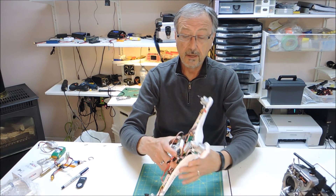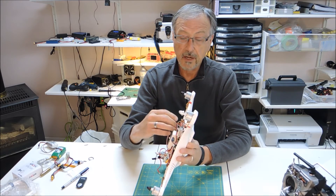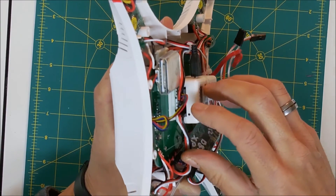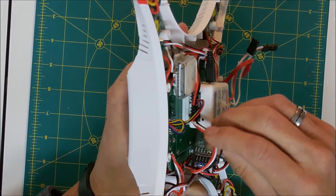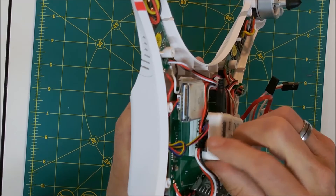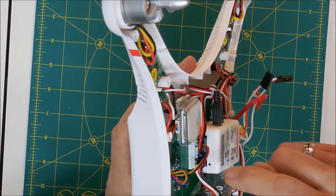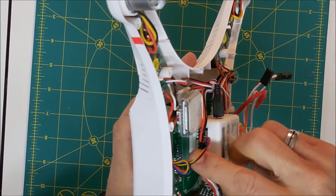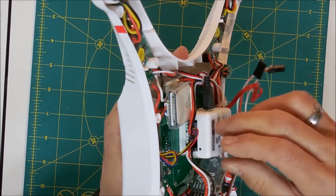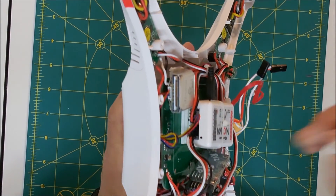Let's take a closer look at that. It's very hard to see, so that's why the diagram is a bit better. We have the servo connection on pin one, and we have a jumper — I don't know if you can see it in there — a jumper on the signal line, on the signal rail, between pins two and three. That's how it changes the configuration to know that it's running on PPM and not PWM.